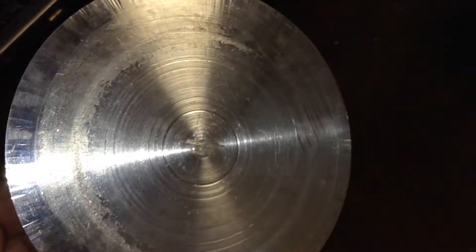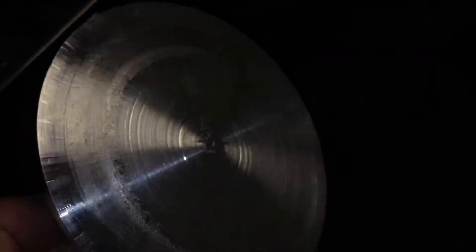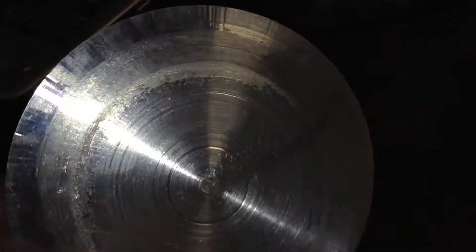So as it was on the lathe, I actually had a little bit of a wobble going. Even though it was centered, it was still wobbling. So I chopped it off — I left enough where I could lathe it in and get the proper pitch. But as you can see, that wobble caused quite a few issues. It actually took me about ten to fifteen times longer just to chop this piece off than it did to machine the other side.